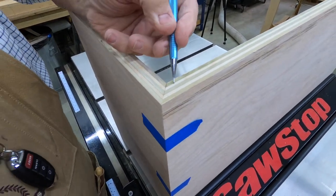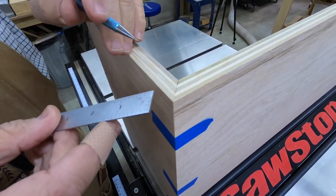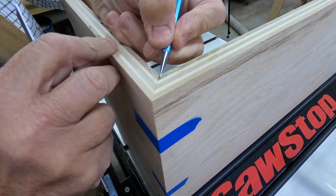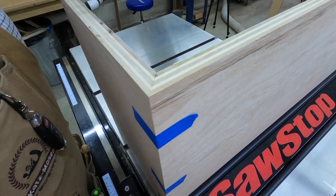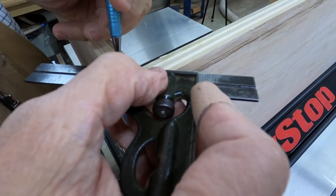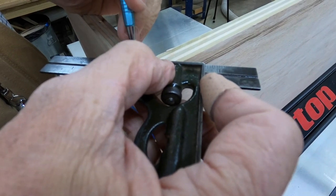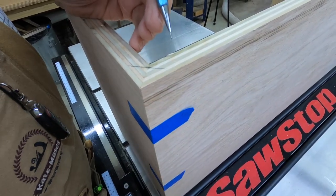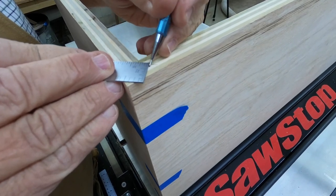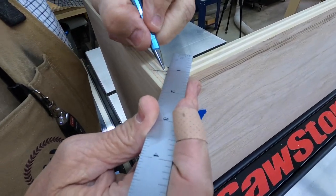So we're ready to lay the splines out with 3/4-inch material. I always like to put 3/4-inch splines. If you remember, our stock piece is 3/16 thick. So I like starting right there. To lay out, you just have to lay the first one out, and once you get your saw blade set, you just cut them all. So I'm looking at 3/4. So 3/8, 3/4 right there, and we're looking at 3/16 thick. That'd be right there.